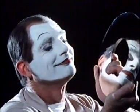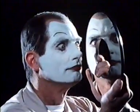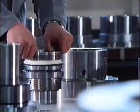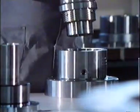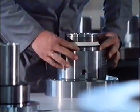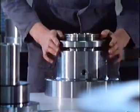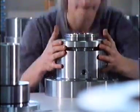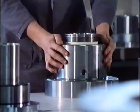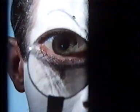The second rule is the sliding surfaces must be perpendicular to the shaft axis. All this requires strict adherence to the permissible parallel run-out tolerance, stable shaft bearing support and careful assembly. Flatness and negligible surface roughness of the sliding faces are preconditions for minimal spacing between the seal faces, for the microscopically small sealing gap.